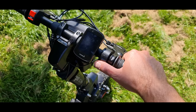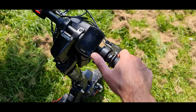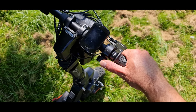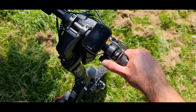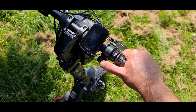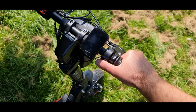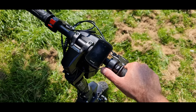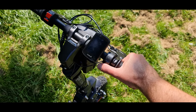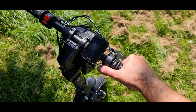So another thing that's quite interesting — this is the throttle. So what I did, and if you saw in the phase runner suite, I created a tiny little gap before the throttle starts. So when the throttle's completely off, regen is on. Now, if you move the throttle in a little bit, there's an area where there's nothing engaged — no throttle or regen. So what you can do is you can coast with it kind of in the middle. It's kind of like an electric car — you've got like one foot which does everything: one position for throttle, one for braking. But you can actually get to a point on this where you're in the middle zone where nothing's actually activated, which is pretty cool.